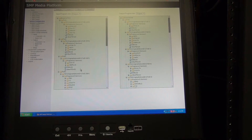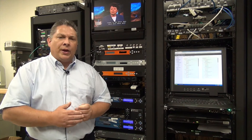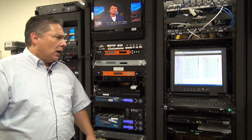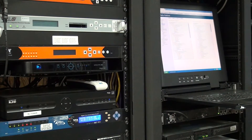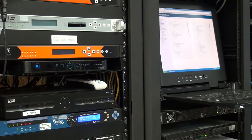The units also come with ASI and TSIP input-output options. On the IP side, you're limited to 12 streams, but basically the 330 takes ATSC 8VSB input, allowing you to cherry-pick and multiplex on the output.